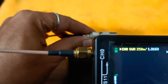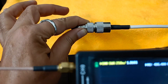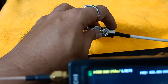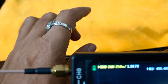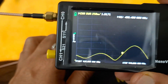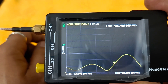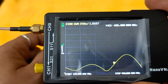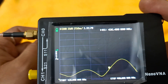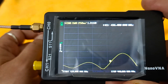The patch cord goes to the PL-259 connector, with SO-239 male and female connectors, and one male goes to the barrel connector where the LM-400 is connected. There are three cables in the vicinity, which is why the SWR will differ from a direct antenna measurement — the antenna is after 20 meters of LM-400 plus approximately 2 meters of patch cord, totaling about 22 meters. Even so, the SWR is pretty good.